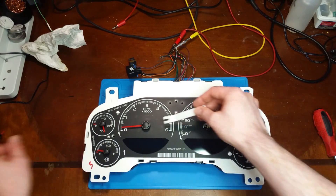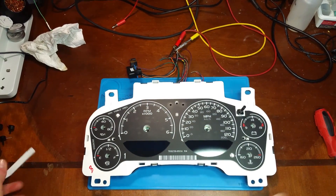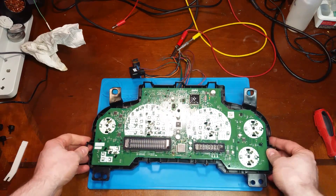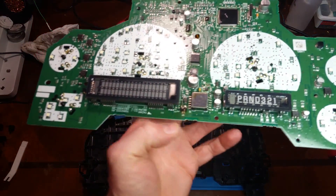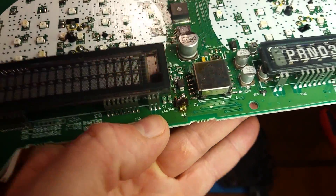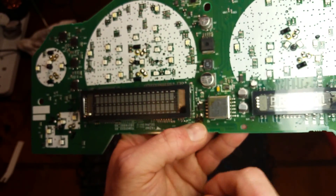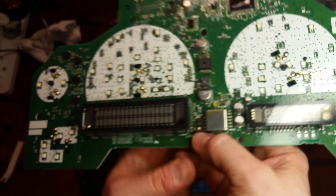Calibration will be easy to fix — I'll just make sure to set the needles right when I put it back together. There's the person's fingerprints right there. Let's see how butchered it is. Here is a trouble area for the displays: this is the MOSFET that runs the hotwire, and it's definitely not happy. The MOSFET is cracked, and they attempted to reflow the solder by putting a ball of solder across two of the leads — looks like right across the gate — so that could be feeding power into places it doesn't belong.